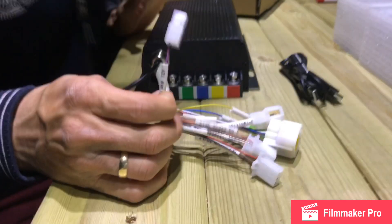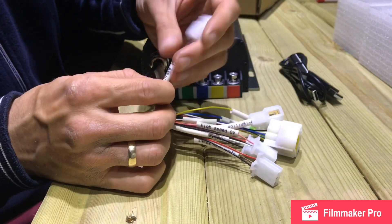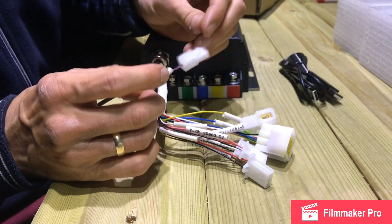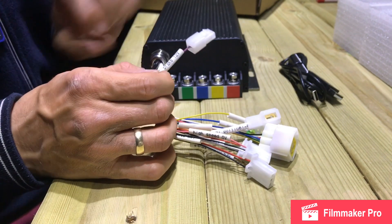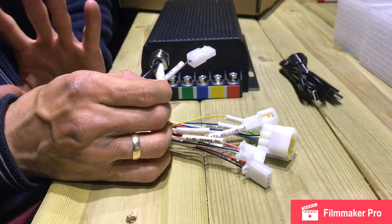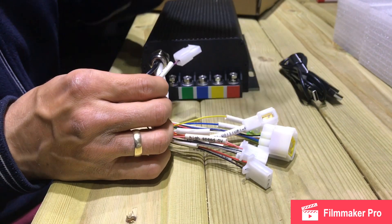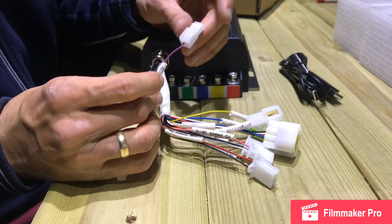The last wire is the brake plus 12 volts. To make it work you need some sort of DC converter with your bike, because it will only work with plus 12 volts. If you wire the plus 12 to this, it will block the rear wheel — block the motor — so this is like an anti-theft system and it'll be impossible to push the bike or ride it.